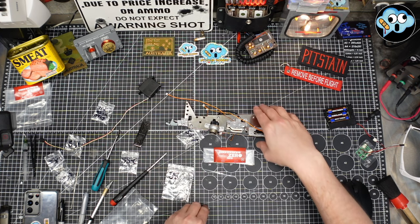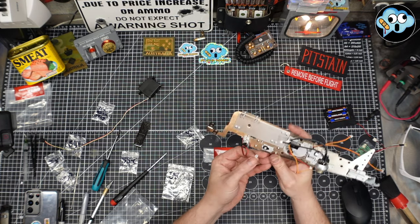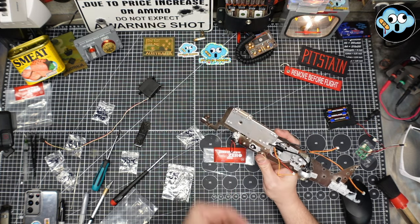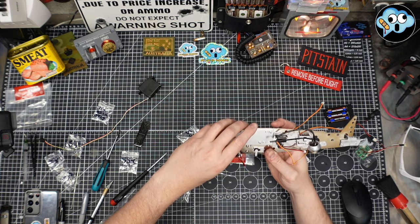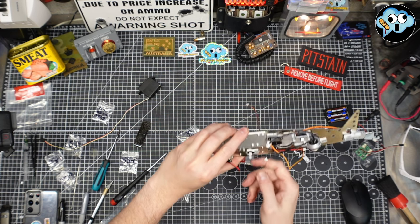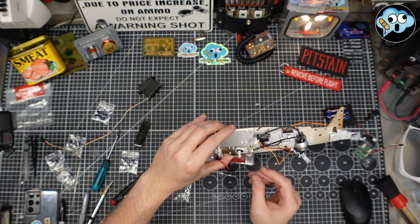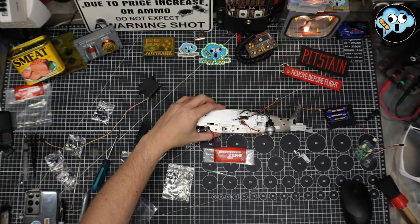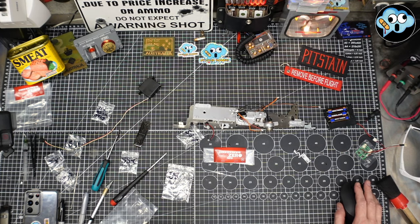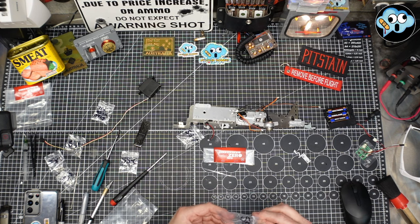And then we're going to put our servo horn on, and we want it to face straight down. So we're going to put her on there and try to get her as vertically straight down as possible. The teeth on the servo horn are never, ever where you want them exactly. But that should be good enough. Should be close enough for government work. And then we're going to want to take one of the tinier screws to hold that servo horn down.